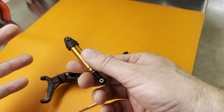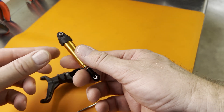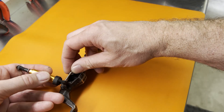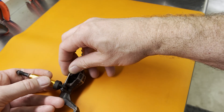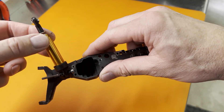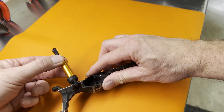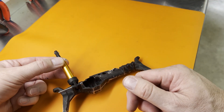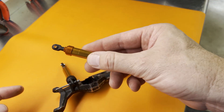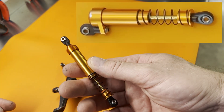Your shock might only fit one way or the other. I really like these Traxxas caps on Dravtec shocks — they're really short, shorter than the stock ones. Almost as short as the offset caps that Dravtec sells. But the problem is they often don't have enough articulation for what I'm doing, so I almost never use these caps even though they're my favorite. I'm pretty much always using the stock rod ends or the offset caps.